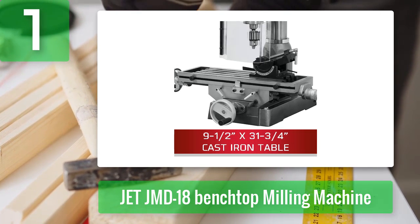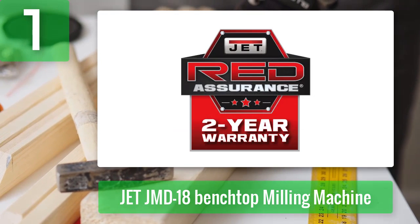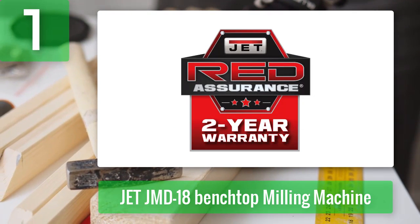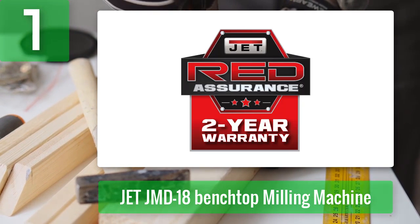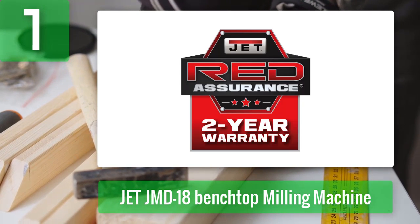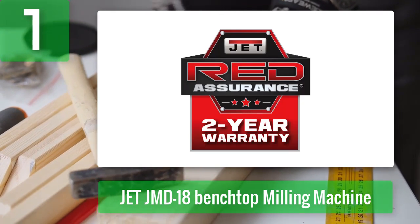The machine covers a longitudinal distance of 20.5 inches. The hinged belt cover present on the machine gives you easy and faster speed changes. It comes with heavy-duty tapered roller bearings that support the spindle. The spindle has a speed range of 150 to 3000 RPM.